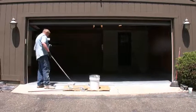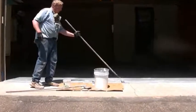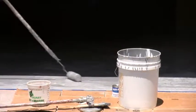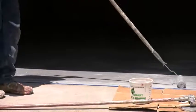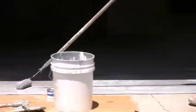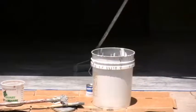I'm going to roll the last little edge. This edge I'm only doing one coat, but I'm taped out a little farther, so I'm putting the coat on just a little thicker. I don't want to float it in, but I can put it on a little thicker here. I push down a little bit on this edge to make sure I don't miss the tape. There's a little dry spot right here — this is a little shallow. Here's another dry spot. It's hard when you transition up. Missed a little spot — if I didn't catch that before we put the chips down, they won't stick there and then we'll have a problem.